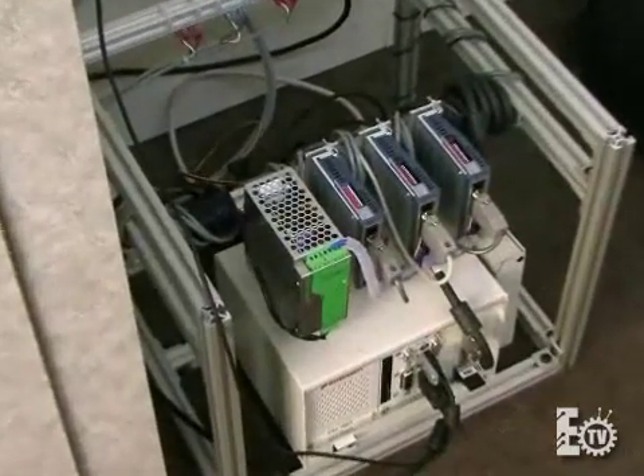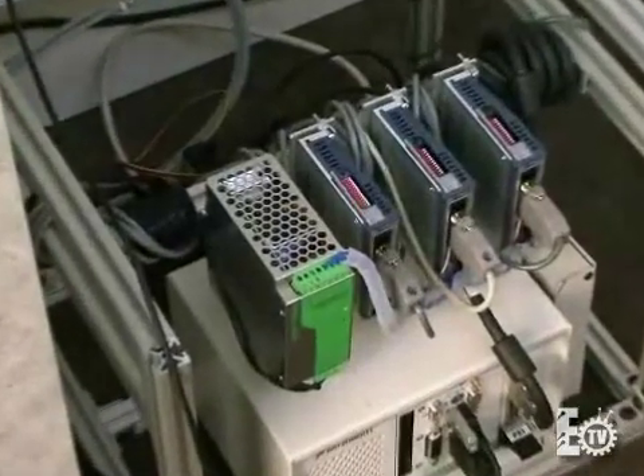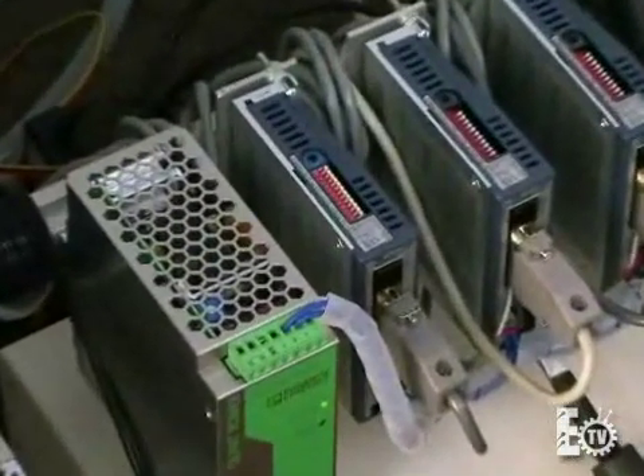Adding a little bit of jazz to it to show the expanded capabilities of LabVIEW — being able to communicate via Bluetooth as well as talking to an industrial arm. What kind of computer hardware did you need? Right now what's running is a National Instruments PXI chassis running Windows XP. In the computer we have a National Instruments four-axis motion card that is sending the control signals via Danaher motor drives, which are sending the actual signals to each of the stepper motors to control it.